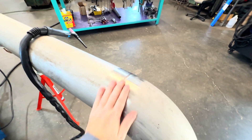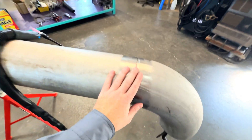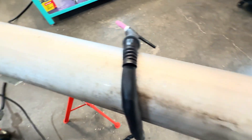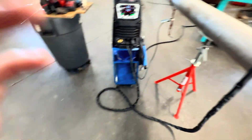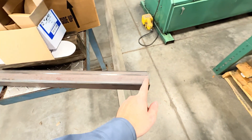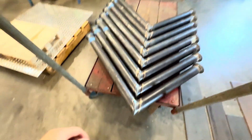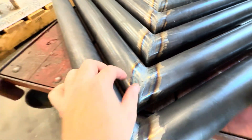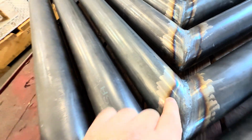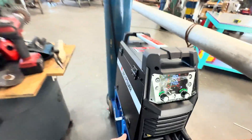One important tip for TIG welding stainless steel: you don't need to do a lot of cleaning, but you always want bright shiny metal — as clean as possible. For carbon steel or black iron with mill scale on top, it's not going to weld well. You've got to grind the mill scale off to bright shiny metal — about an inch past where you're going to weld. Otherwise it'll start popping on you. The cleaner the metal, the better it welds.